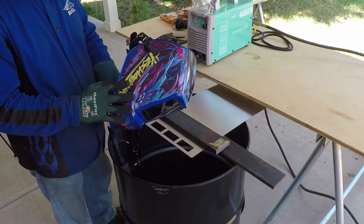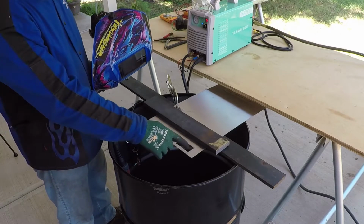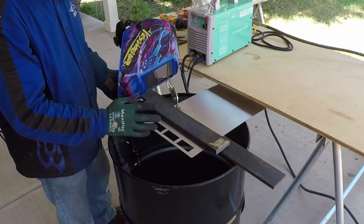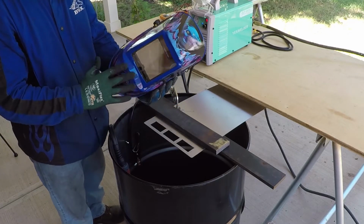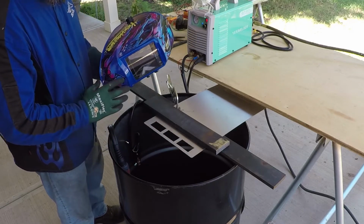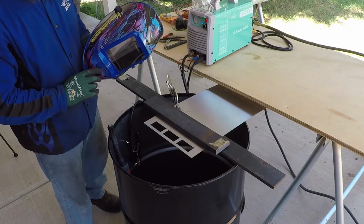I did say to make sure to use welding mask when you use a plasma cutter, because the flash produced by it is similar to the welding process, so it will damage your eyes if you don't use welding mask. This has a shield inside to protect you from the rays generated from the welding process, or the cutting process in case of plasma cutter.